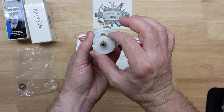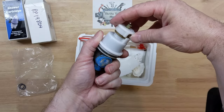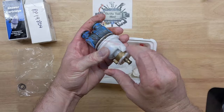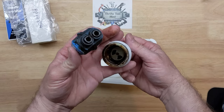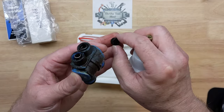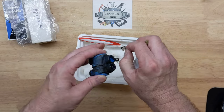Here's a little bonus — on my bench you can see the stop a bit better. I'm showing how that old valve worked and how the mechanical stop prevents it from going too far toward hot for scald prevention. I also want to talk about a cheaper way to do this repair: you can take this valve apart and inside you'll find a stainless steel disc and these springing seats. This is why it starts to drip — the seats get hard and the springs get weak.